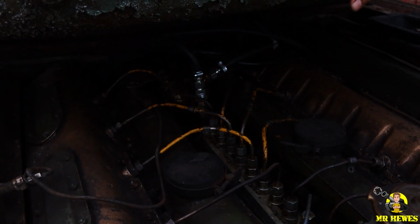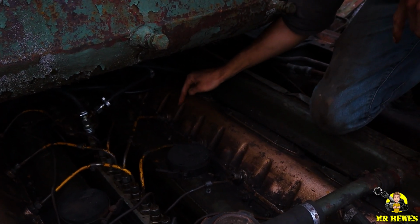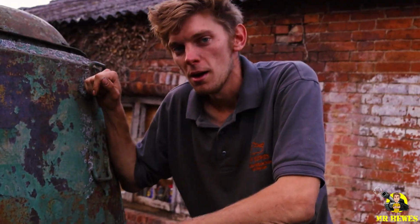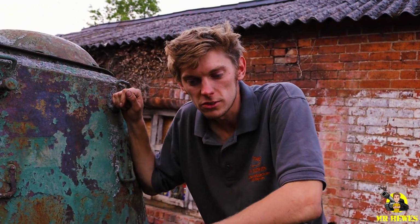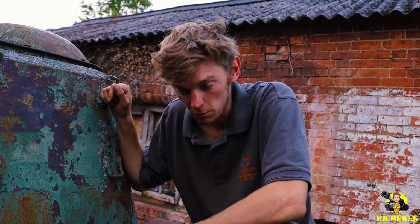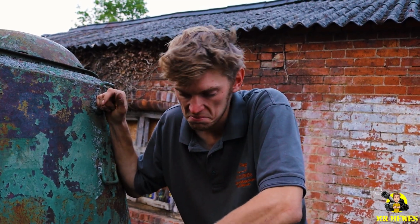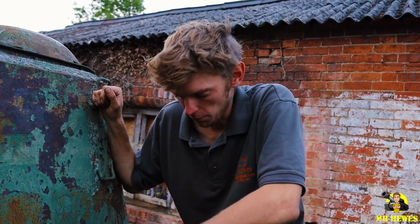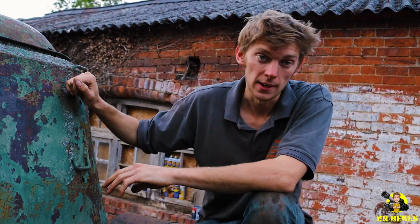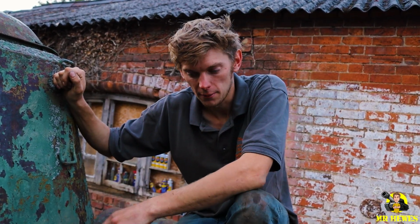Now we did do that, and we took this cover off to look at the cam to make sure that obviously the cams were closed on number 1 cylinder like the man said, but sadly still no luck. It only fires with a bit of easy start, it won't carry on running on its own fuel. So rather than waste any more time, I think we may have some stuck valves potentially, but either way I want to restore this vehicle to a pretty good standard, so the engine's going to have to come out anyway, so it's pointless wasting any more time on it how it is now.